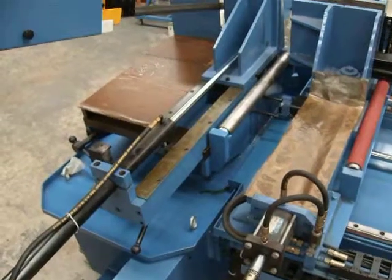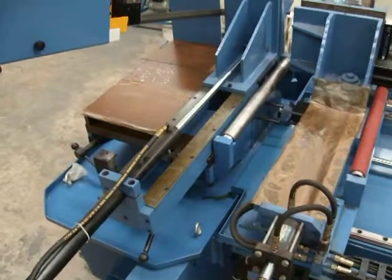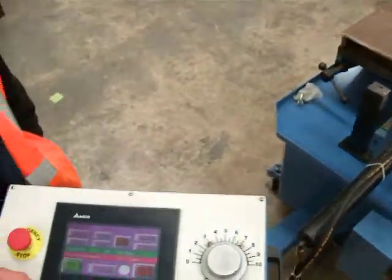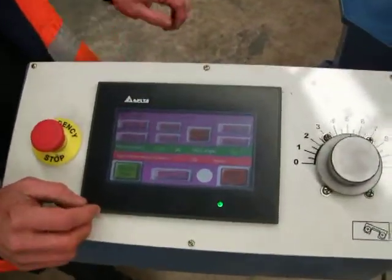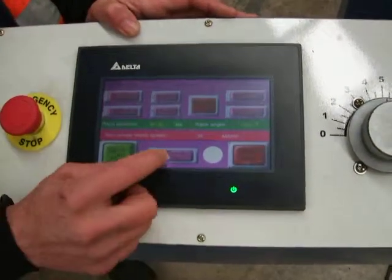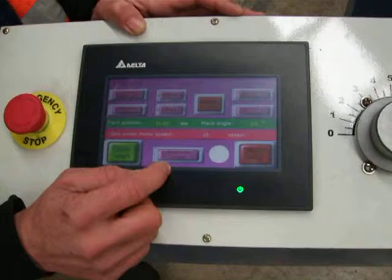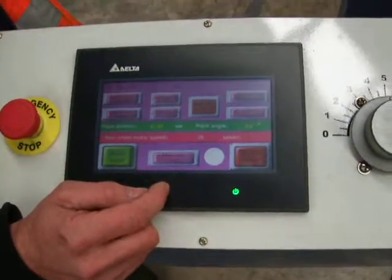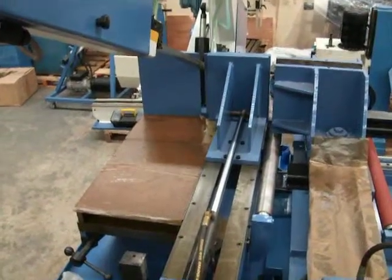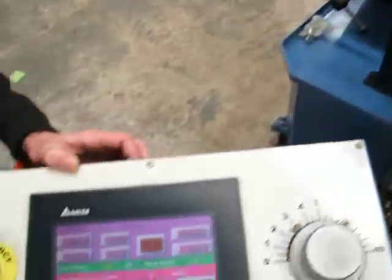This is Russet Plant Machinery. Today we're looking at the SteelMaster 620HA Automatic NC Band Saw. Just panning over to the controller. We'll turn the hydraulic pump system on — the machine has now lifted the head and is positioning the vise. The machine now has its origin light lit, so we know it's ready to start work.